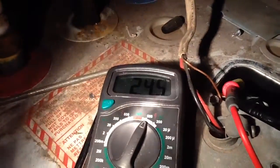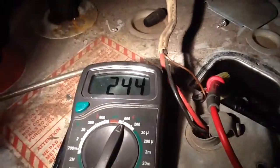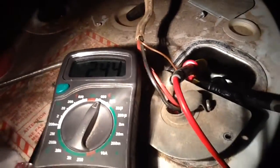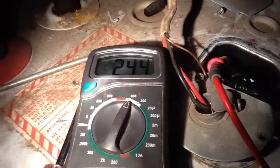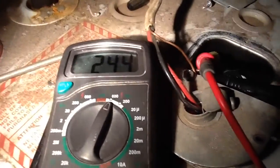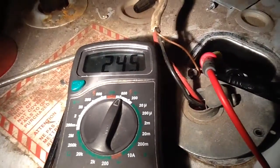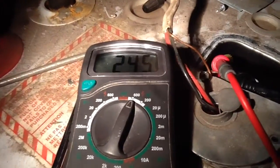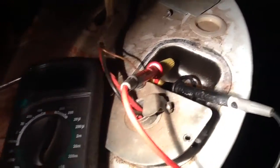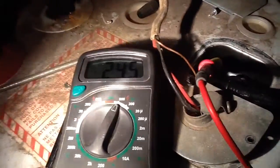Since I've got power on the line, that means there's something wrong with my hot water heater — the element is not turning on. I'm not sure on the amperage; I don't have an amperage tester to see if it's pulling any. It looks as though maybe the element is burned out or something else is wrong, but at least I know the breaker's working.